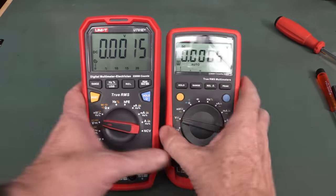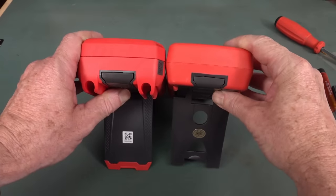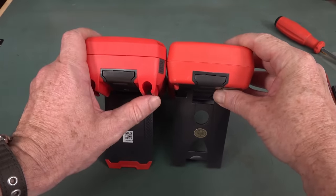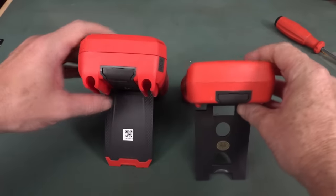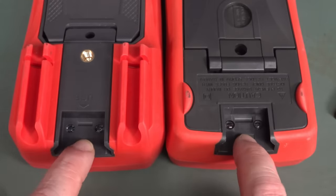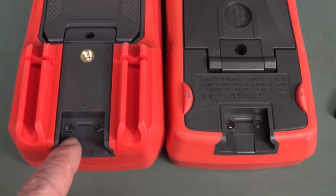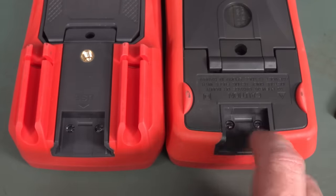Both meters have really good tilting bales, nice and wide at the bottom. The new one is a smidgen thicker and stands up a fair bit higher at the top side given the holders. They've got exactly the same USB interface externally, but as we'll see in the teardown, the new one actually has a receiver while the old one only has a transmit lead — it's just a fake.